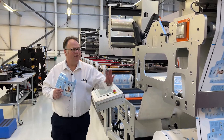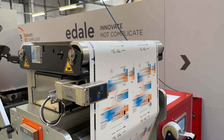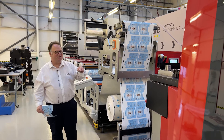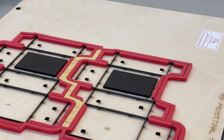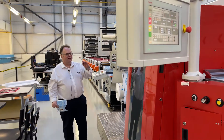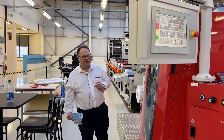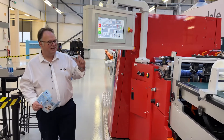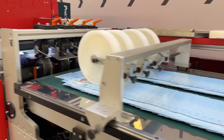We can either run reel to reel or, in this case, we're going through a flatbed die cutter. We have a web guide which allows us to run the board directly into the flatbed die cutter in the right position. The flatbed die cutter uses traditional wooden dies that are commonly used in the carton industry, so very little cost. This will give us a hundred and sixty five tons of pressure and thirteen thousand impressions per hour. At the end we take the board, strip away the waste, die cut, crease and deliver onto a converging conveyor which allows easy removal by the operator.